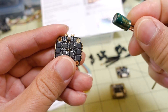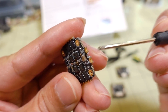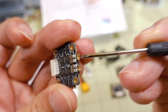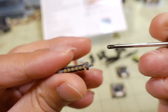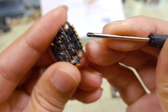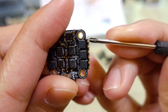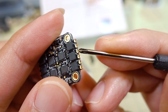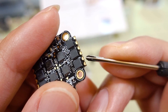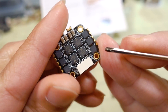You'll probably definitely want to use the additional capacitor for additional filtration. For your connections, your battery lead goes on the ends — the connector goes from one side and it's copper-plated over to the other, so it should be a pretty solid connection if you solder it correctly. The motor wires go on the side here, and this is actually pretty compact to build up. These are going to be good connections if you solder up properly right on the side — it's really meant to solder directly on the side. Get some solder on the top and bottom, and solder your wire directly into that little groove, and you'll get a nice connection even though it looks tiny.